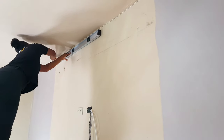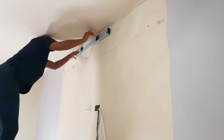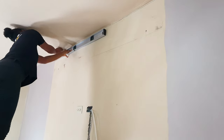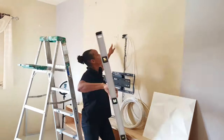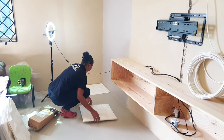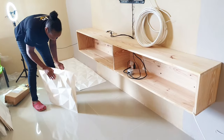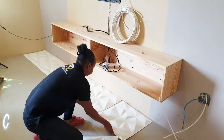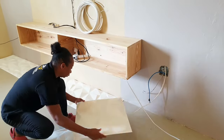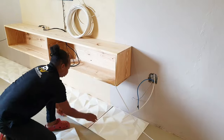This step is optional because I'm going to start laying the tiles from the bottom up, so whatever space is left at the top I'll just fill it out with the tiles. Now I'm arranging the tiles on the floor so that I can select a pattern for installation. There are basically two patterns, so I'm rotating the tiles just to find the desired pattern that I'm going to use.